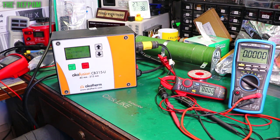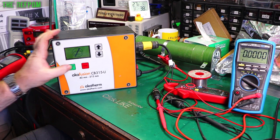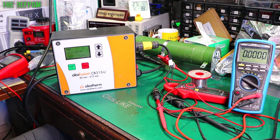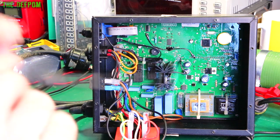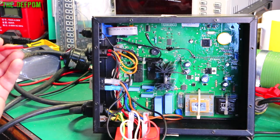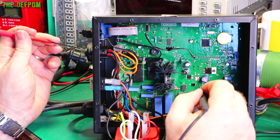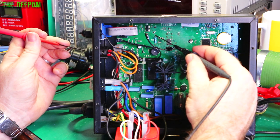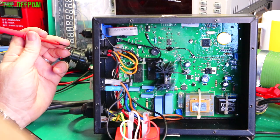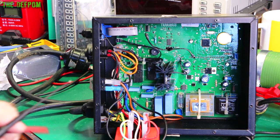No fitting. Oh really? It's all plugged in properly. No fitting again. Oh God. Well, we've got something else going on. Now previously when this failed to detect a fitting, it was this resistor up here that had blown open. I can check if the lines from this socket are going to the places they're supposed to go. Measuring that pin to ground - I should get a connection, and I do. From the other pin to this resistor - I should get a connection, and I do. Other side - nothing. Getting 33K. Well, it's not a 33K resistor. So that's gone.